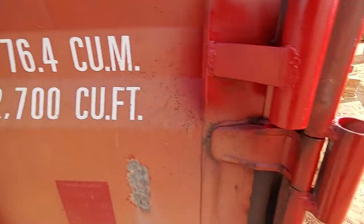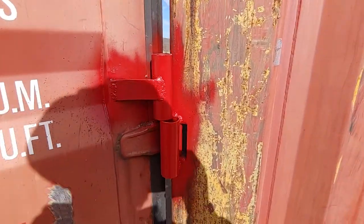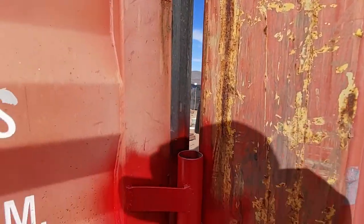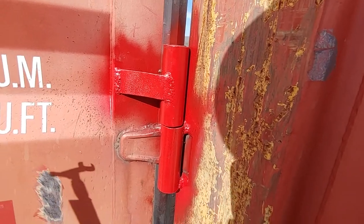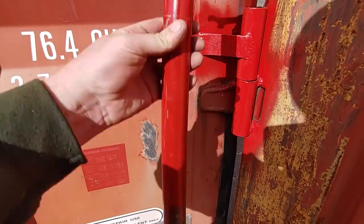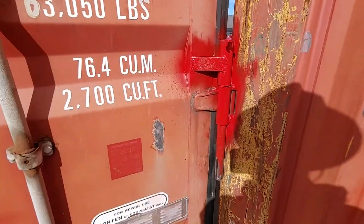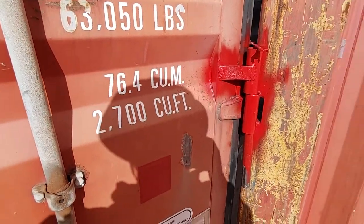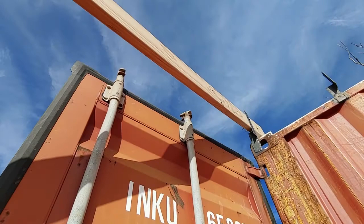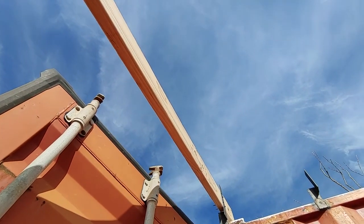We'll open the door right now. I'll show you how this works. So if the wind comes out, there's the brake right there. It hits the brakes, and if I want to keep the door open all the way, I took this old pipe and a broken old wrench and welded that together. And there we go. That'll keep the door from closing. So if the wind picks up, it doesn't slam into me and throw me across the yard. And it won't open up all the way and hit the roof. That's as close as it'll get. I didn't want it to get any closer.